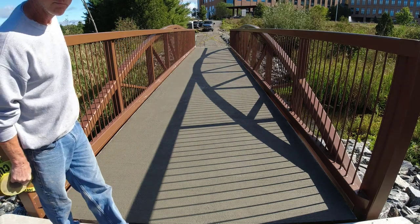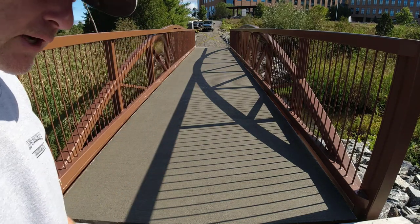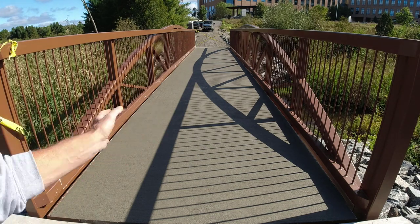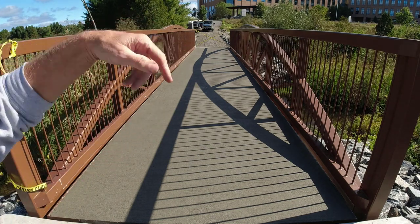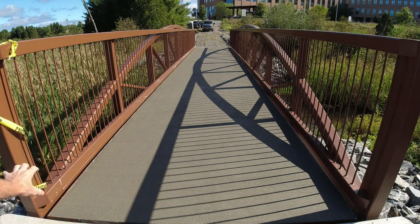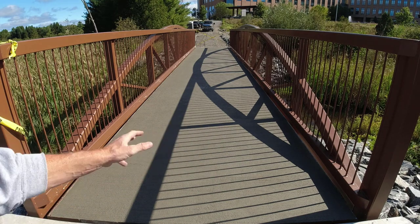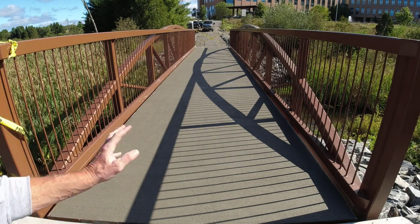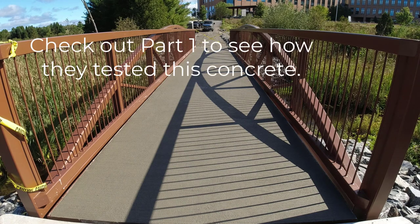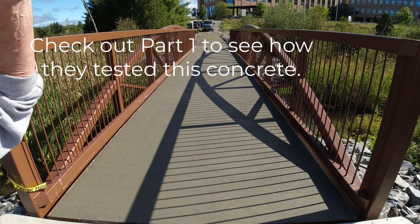All right, well, that's it. Broom finish. It actually didn't float out too bad, so it made it real easy with four guys, too. You can see us working our way through all that railing, kind of tricky. Whenever you broom finish, it's nice to broom and not have to stop and start, not have to go both ways if you don't need to. It just makes the broom marks come out nice and straighter, a little more even. But that worked out really good with Harvey out there on the outside.